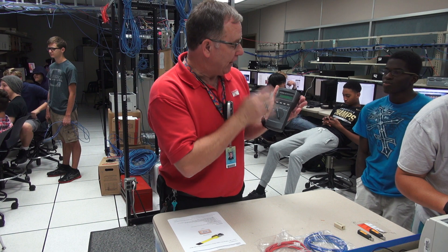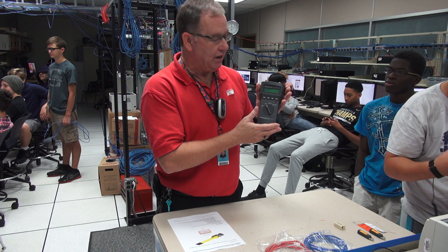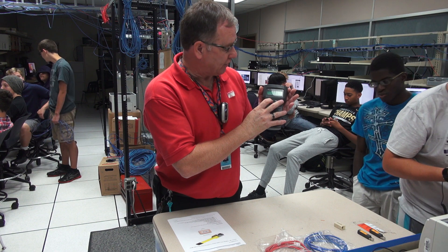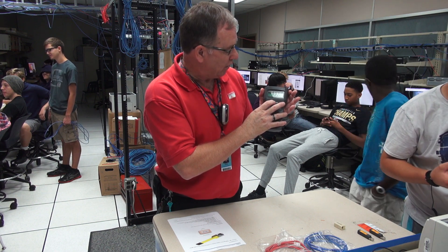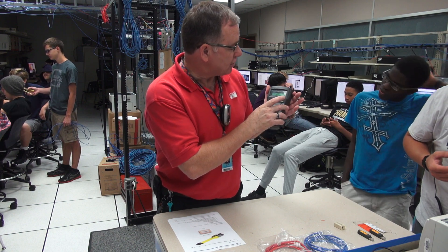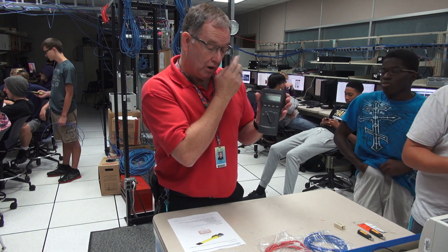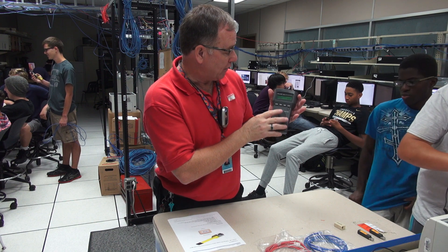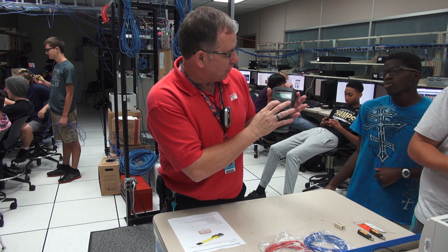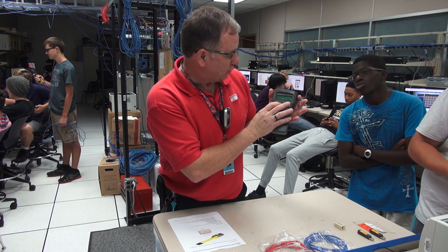Hit enter to the next feature — here I can select the cable category. This meter is capable of doing CAT3, CAT4, and CAT5. It's set on CAT5 now, which is the correct setting. The next setting is wire size, so you need to select the gauge. You can get that off reading the box or sometimes you can read it right on the side of the cable. This says AWG24, which is the size cable we'll be testing today. You can also choose 22, 26, 28, or 24 gauge.